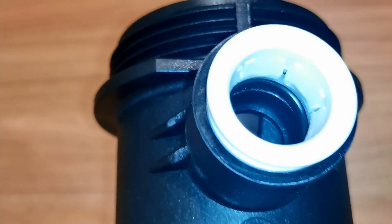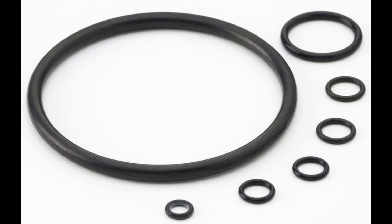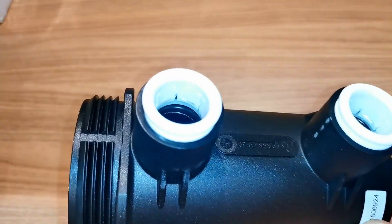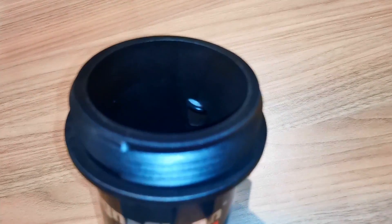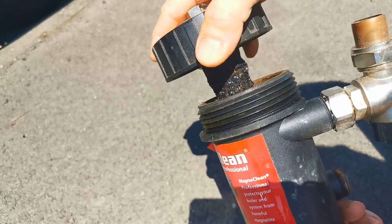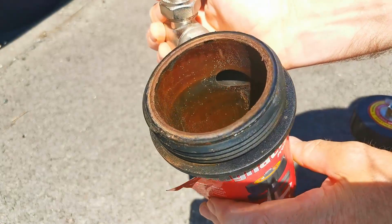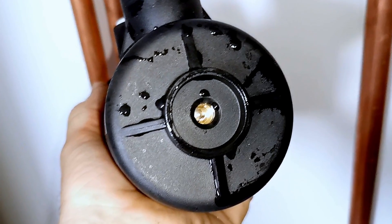It may be possible to get a small tool in there and hook out that o-ring — let me know if you've managed to do that. AD do not sell these seals as a spare part and they do not come in the seals replacement kit. The last thing I want is to tell a customer that the canister is leaking and they're going to need a new one costing around £40, and if I haven't got one, they'll be without heating and maybe hot water until I return with a new one. I haven't come across this problem yet — it's just a concern for the future. If you're thinking of removing the canister to clean inside it, remember that anything on the inside of the canister is also on the inside of all your pipework and all your radiators, so there's not much point just to clean the inside of the pot. On the bottom of the canister you'll find the drain plug hole with a nice brass insert.